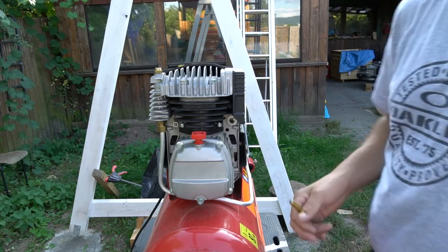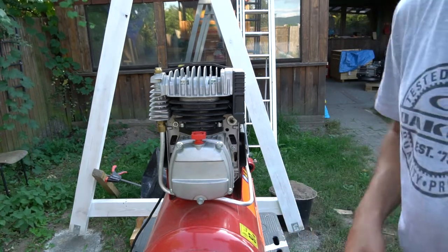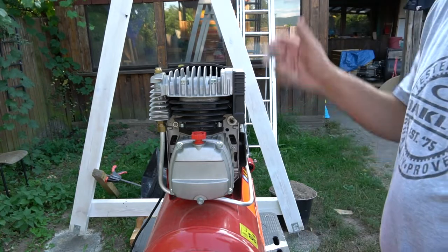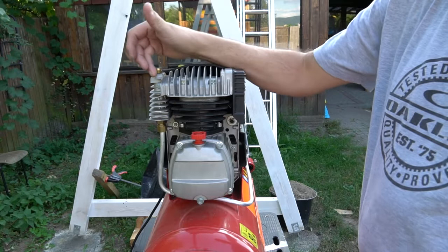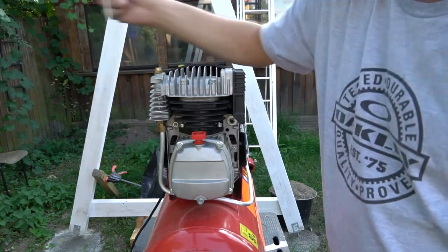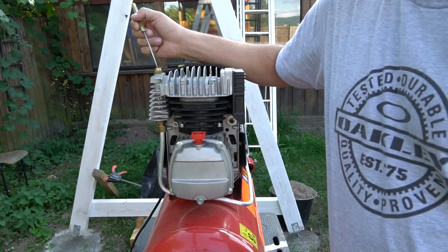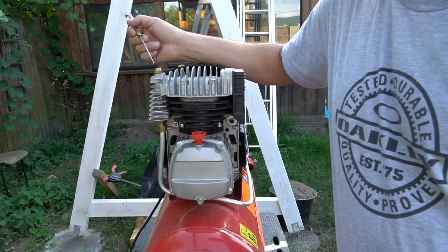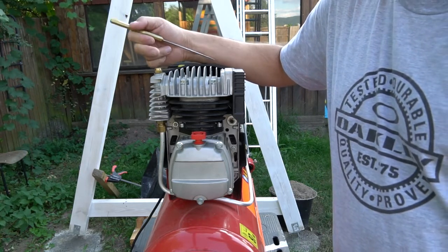Simple system, works like a four-stroke engine, just without ignition. The only difference is we are pulling air inside here, compressing it in the compressor unit and pushing it out through this pressure pipe — this aluminum pipe — this is the main pressure pipe. This is a small overpressure valve in case that something is not working as it should be, so the pressure can come out here from this valve.